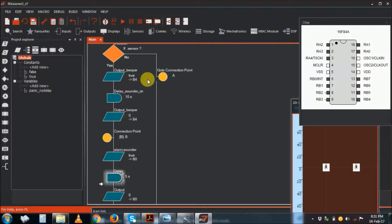When you compile it, remember it outputs a number of files. The only file that you are interested in is the hex file. That is the file that you put into the PIC, you burn it to the PIC. And here please choose the correct PIC. Choose the correct PIC here and configure it to the settings that are required. The most important is the frequency and whether it's internal or external. And then the other things are memory locking and all that. Sometimes the defaults are okay.